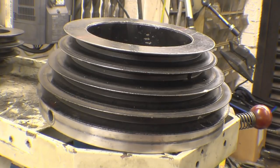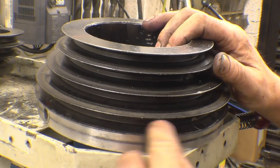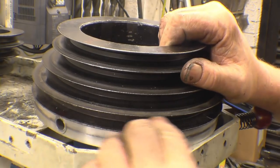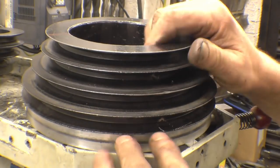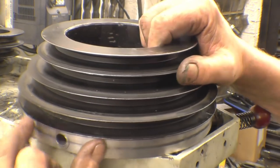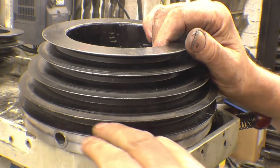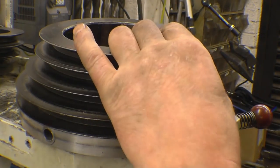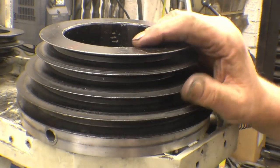If you look on the pulley, there are some sort of chatter marks on the sides. There's one or two ding marks like that. That's not causing it, but there is a definite mark there. It's marked there, it's not marked there. It's not exactly a top class pulley, it's a cast iron pulley. They've squeezed a lot into a short depth, so they have very, very thin webs on it.